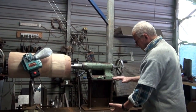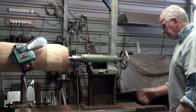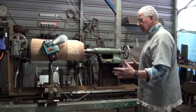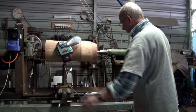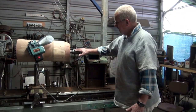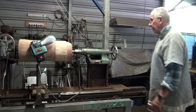That lathe had a base on it that you could hardly lift — it was so heavy — so we eradicated all of that and built our own tail stock function. All of this UB here was pieces I had, and we bought $20 worth of a couple of pieces — the vertical there and part of the bed itself. The bed is 1800 long and the height is about 700, so the height of the tool rest will be exactly centre at 725 in height.